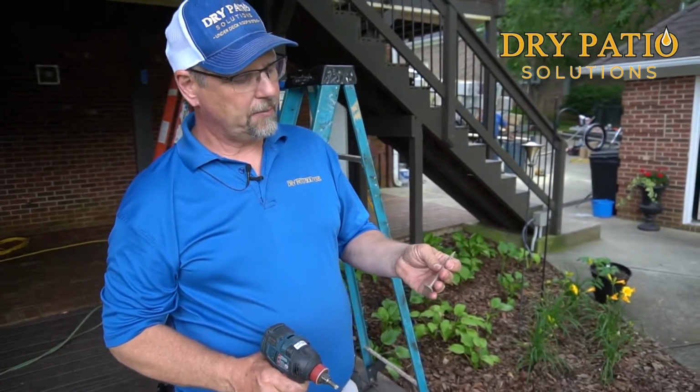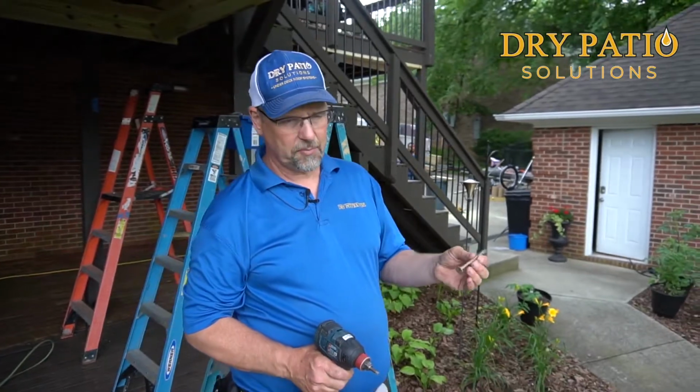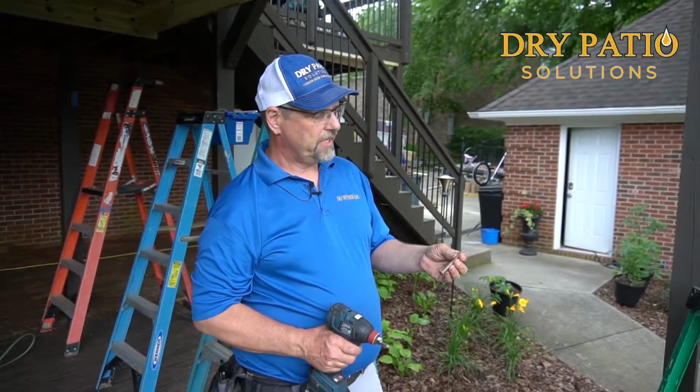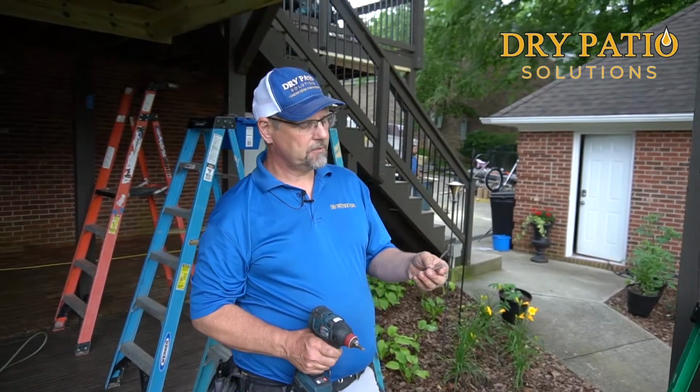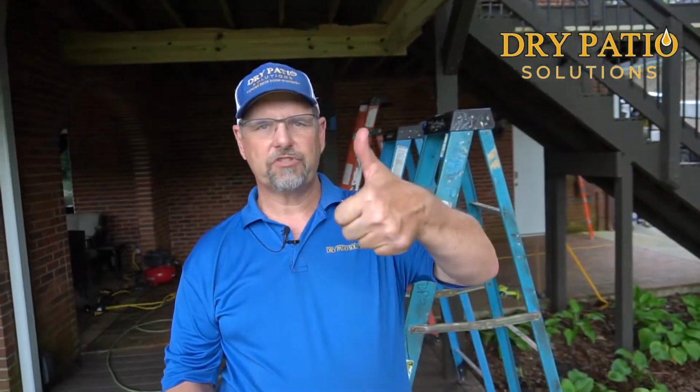I do know how much they cost. I think these are around 69 cents a piece. And we use a lot of them on a job rather than just nail things together. When you nail them together, the nails pull. We've all seen deck boards where the nails are sticking up out of the deck boards and you stub your toe, et cetera. Well, that's the same thing that can happen with our system if you don't use structural screws.